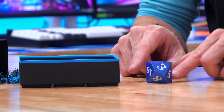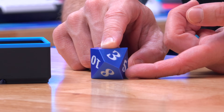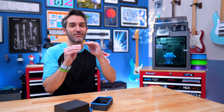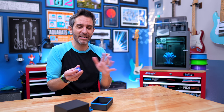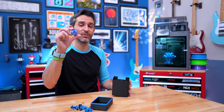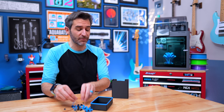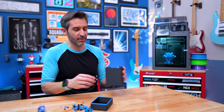My wife asked me to print a 10-sided die, and it has multiple colors — blue and white. This produced the most waste I've seen so far, because unlike the box that printed all one color before switching, this die has both colors mixed throughout. It had to switch every layer — I think the total print was around 250 to 300 layers, and most layers included a little bit of blue silk PLA and white. So every layer the printer had to switch from blue to white, about 250 to 300 times. It filled up about one and a half bins. If you do a lot of multi-color prints like that, I'd recommend printing a larger poop chute.